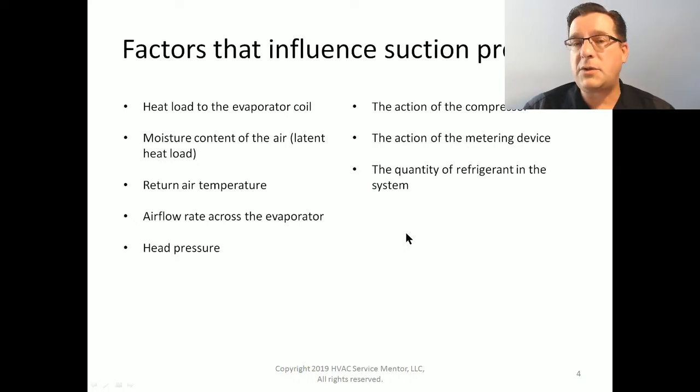In the event that you do have a slow leak, as refrigerant is leaking out of the system, you're going to reach this unique critical point where there is still enough liquid refrigerant hitting the metering device to create refrigeration effect, but not enough of a loss, I should say, to create a lower suction pressure, and you could be hovering around in near freezing temperatures. And as a result, because we're not cooling enough and it's warm outside, it runs long enough to start to build a band of frost across the evaporator coil. And that is going to lead to a cascading failure.